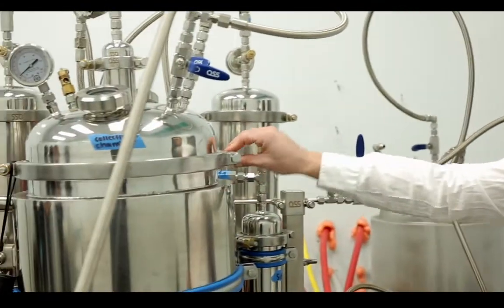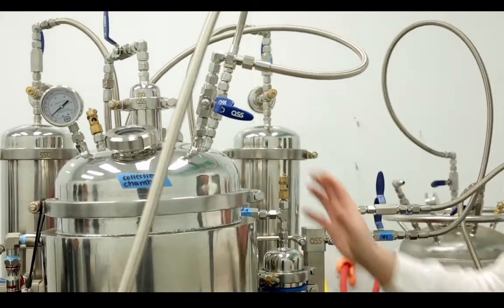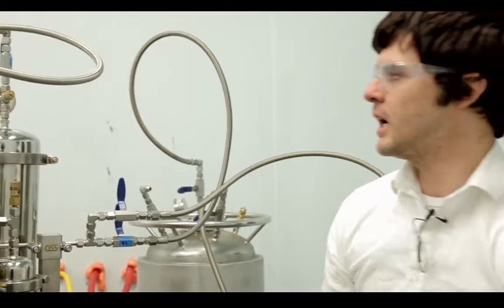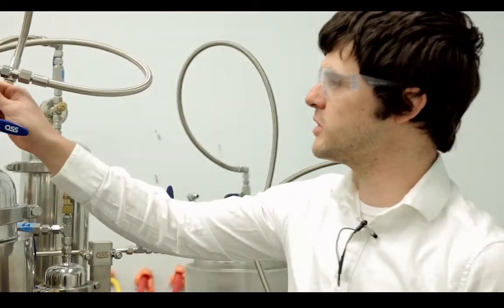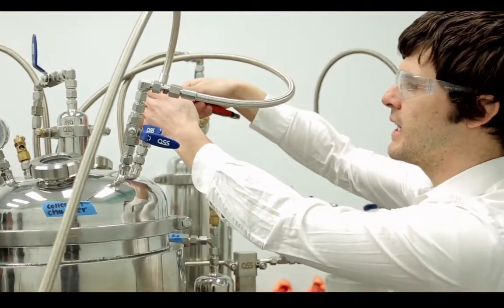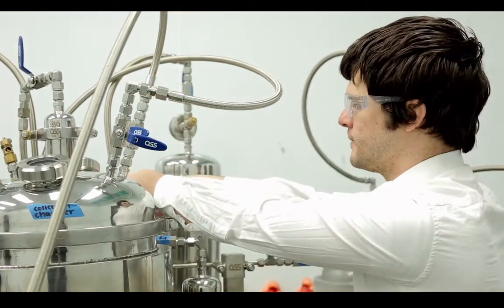So what we always want to do before we start any type of extraction, even if it's just a vacuum atmosphere, is check common items that become loosened over time with pressures running through them. All of our brass nuts, our connections, and hoses, we want to do a double take on everything to make sure everything is snugged up really nice and tight. And for our vacuum hoses or our gas hoses, our 3/8 braided line, once again, we never want to over tighten anything. Slight quarter of a turn.